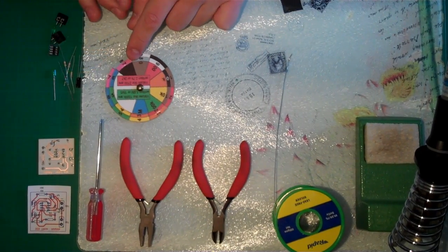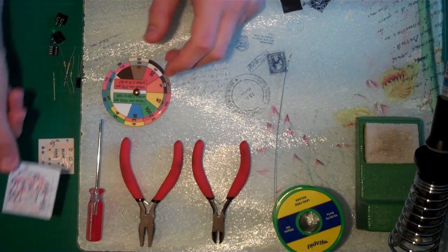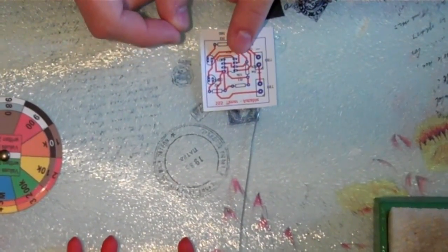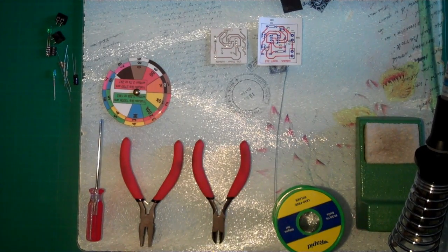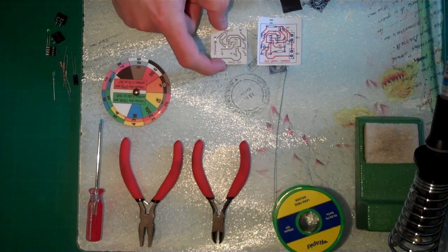I've also got a little resistor calculator which we'll see how to use in a minute. I've got the normal view from Circuit Wizard which will help me to position the components in the correct place, the circuit board itself and also my components. I'd advise to solder the low profile components first — this basically just means to solder the smallest or lowest height components first. You can use a set of helping hands but I prefer to just hold it flat on the board.